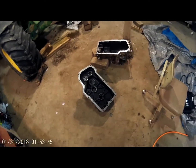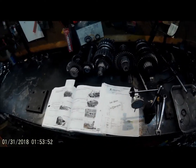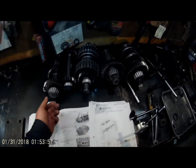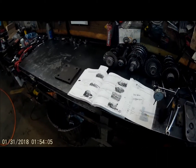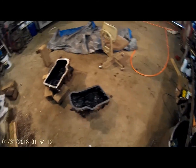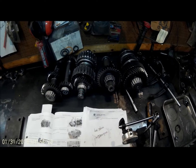It's going to be tough to get done on five different shafts all at the same end play. So we are going to try to go together with basically the same shims that were in it to begin with, even though we have new bearings and everything is going to be different. We are going to try that first, take some measurements, and go from there. Please forgive my voice — I am still fighting off this chest cold and trying not to lose my voice.